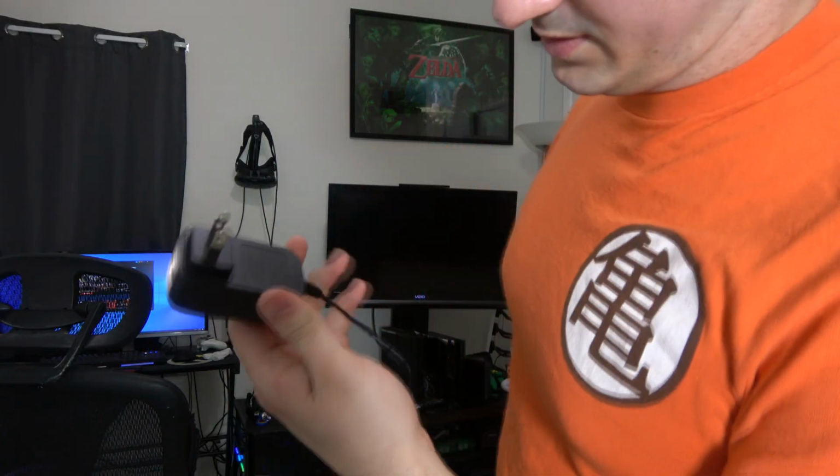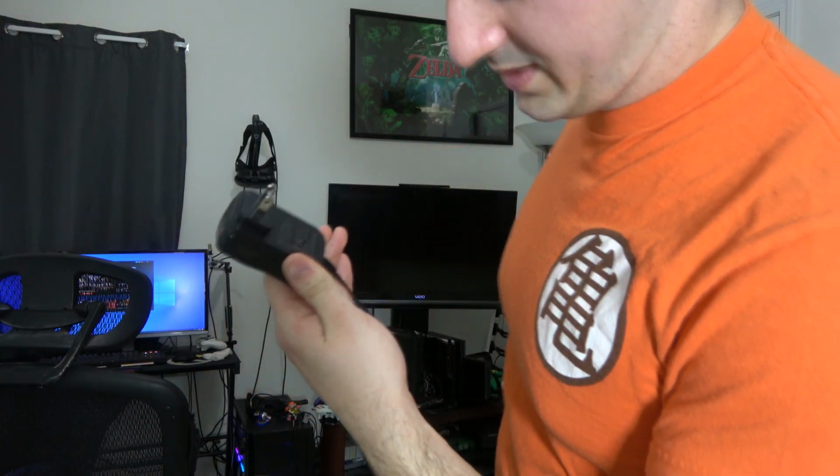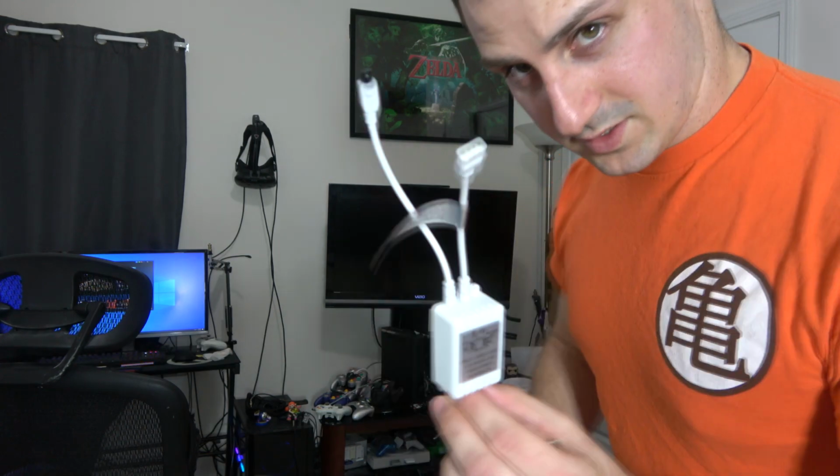It uses a little IR remote. 12 volt, I think it's like a 1 amp. 0.8, no, it's a 2 amp. 12 volt, 2 amp power supply with a little RGB control box with, this is the receiver for the IR, so you want this to face the room if you can, and this plugs into the RGBs. Yeah, so let's hook this up.